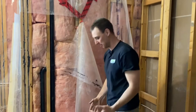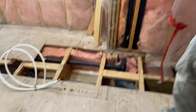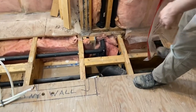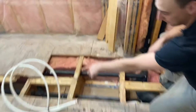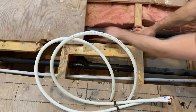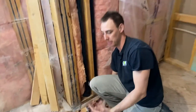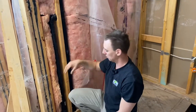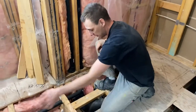Over here it was a bit weird — Clayton did a lot of this work but it wasn't done properly. When we cut it open, the drain dropped down and it wasn't being vented properly. The trap arm was well over six feet for the tub, so we redid it. We added a vent back there, back-vented it, came up here, and tied it above the flood level rim — because down here is technically going to be a wet portion of the vent. If there's ever a backup, you want it tied in here so water isn't going back and clogging whatever vent this is for downstairs. It's all up to code and we're getting it inspected tomorrow.